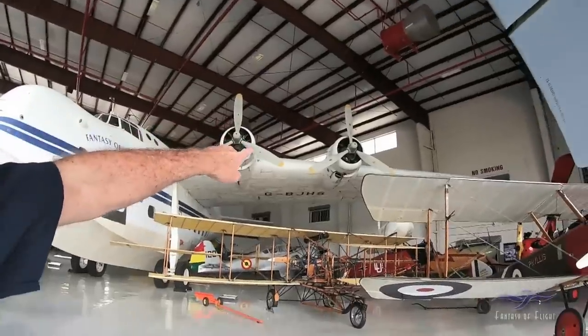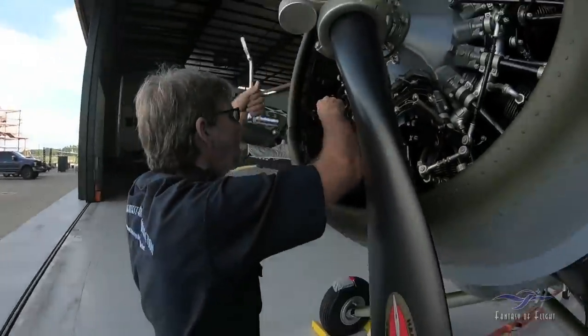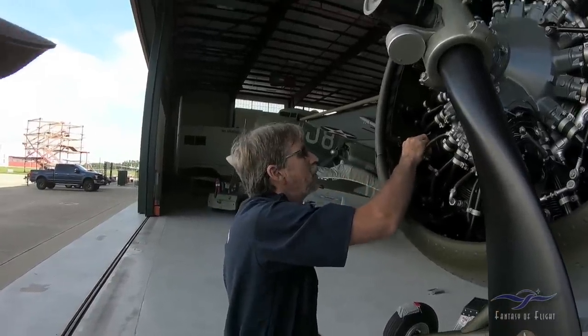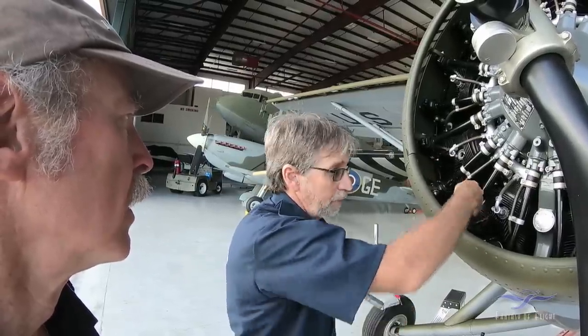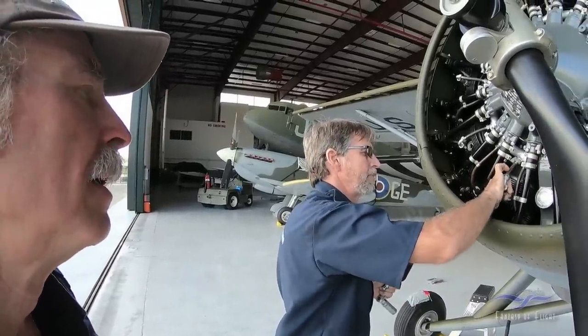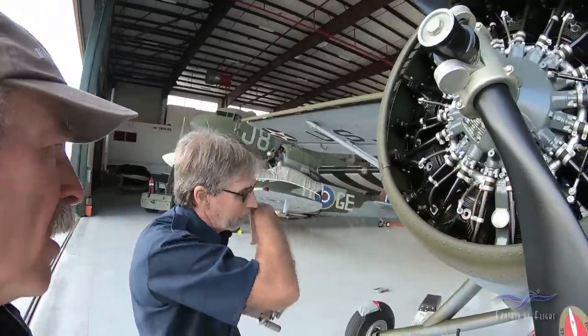But what do you do with big airplanes? On airplanes like the Sunderland, where you're out over the water, or a DC-3 or something really big, you can't actually turn through by hand — they've basically got a clutch on the starter. All starters have a clutch and will break free. The problem is if you don't motor them through long enough to pull all that oil out, the engine can fire and lock up. Your only really safe way to do it is to pull it through and listen — you can hear the gurgling. If you hear gurgling, stop and pull the plug.